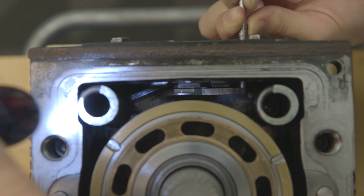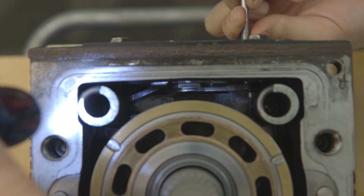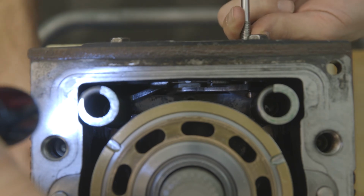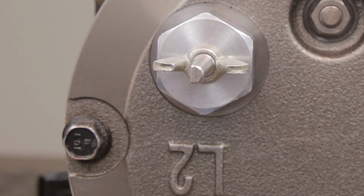Once the technician thinks the tool is properly installed, they can turn the seal nut furthest away from the drain port to see if the tool moves. If the tool moves, it is likely properly installed. However, avoid turning that seal nut if it is not leaking. Look at the flat surface on the post of the wishbone. When it is oriented in this direction, the tool is likely properly installed.